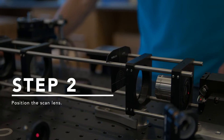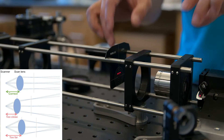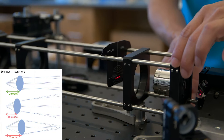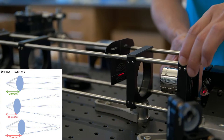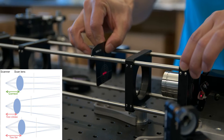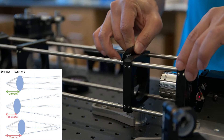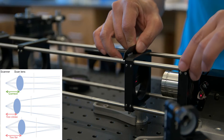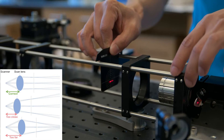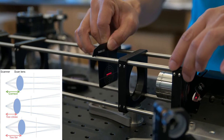Activate the scanning in the software. Insert the scan lens and drop a target behind it. Move the scan lens so that the size of the scanning pattern is roughly the same as it is propagating along the light path. The pattern is not always sharp, because the laser is focusing and defocusing in this region, but the overall size of the pattern should not be magnified or demagnified. After this step, the pivoting point of the scanning mirror is at the back focal plane of the scan lens.